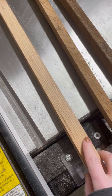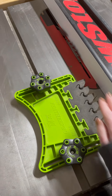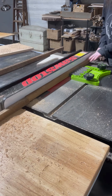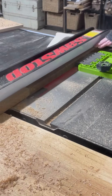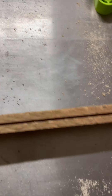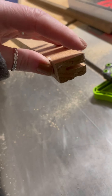So now when I run this through here, it's going to cut about the height of my sign. I know that I want this to be the inside, so I'm just going to line these all up so that I know when I pick them up I'm going to run them through this way. I am grabbing my Feather Pro because this will help prevent anything from kicking back. Now you're left with just this cut that does not go all the way through, and then next we need to cut that piece off.